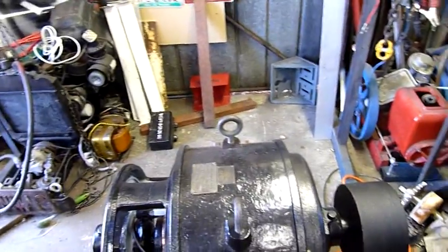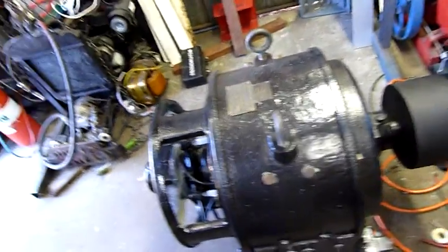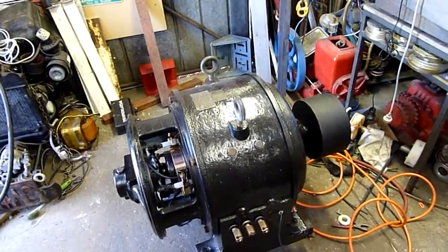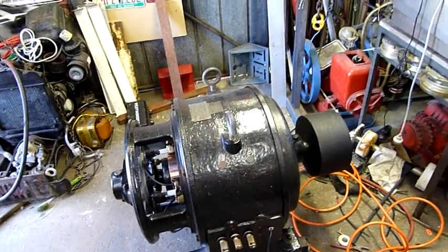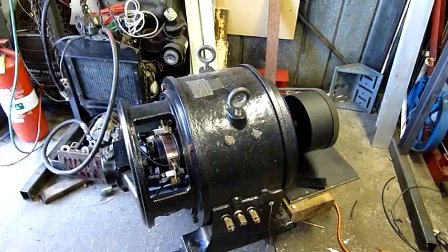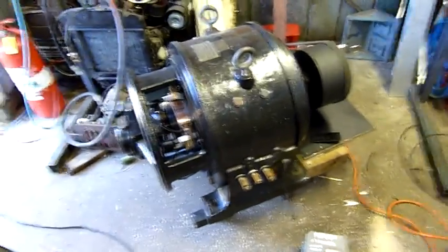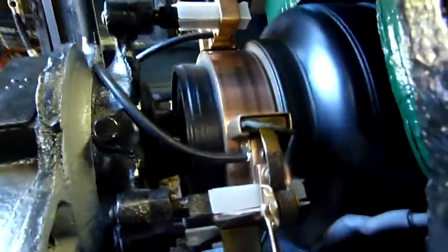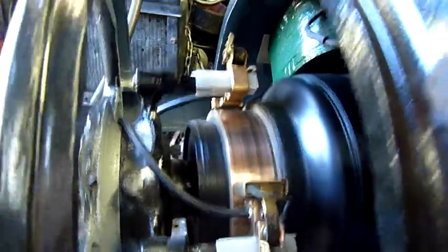Apart from the turret lathe, this is the heaviest. The turret lathe weighs about two tonne, maybe two and a half. This one here weighs almost half a tonne — metric tonne. None of the connections are bridged yet, but it's running off a one-horse motor just for testing and bedding in the brushes. I did the emery cloth thing and bedded them in a bit better. Still not the best, but a lot better.